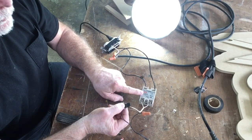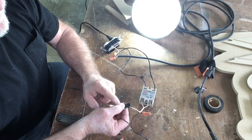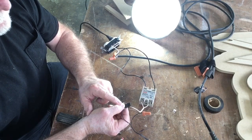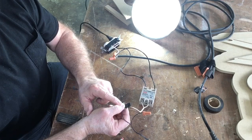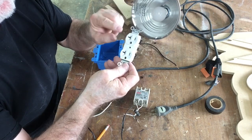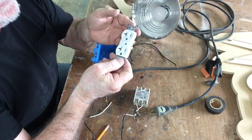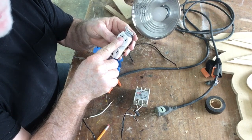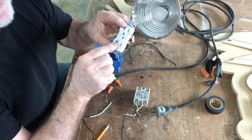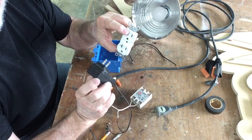Now I want to do the actual wiring. I also want to put a switch on this power supply for my low voltage, because I do not want that little transformer running all the time. I'm running an additional 20-amp circuit into my breaker panel, using a 20-amp rated outlet. I want one side to work for the central vacuum, and on the other plug I want to be able to plug in my power supply, but I don't want it on all the time.